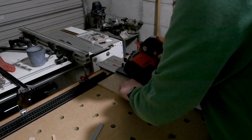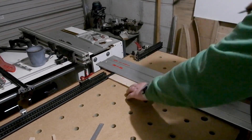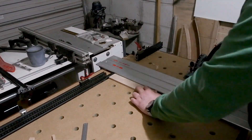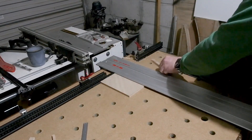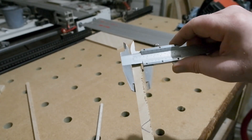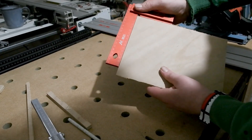That's the build and adjustments all done. All I'm doing now is a five-cut test to check for square. I'll try and keep it all one take and speed through some bits. First cut edge gets marked so I know where I am, then I turn the cut progressively until the marked side comes back around. I'm blowing under the rail between cuts — not always necessary, just want to give the setup its best chance of producing square. When the marked side comes around on the fifth cut I make sure to cut off a measurable rip. On the verniers it lines up perfectly at 13.02mm at one end and precisely 13mm the other — two hundredths over 190mm length. In woodworking terms that is exactly square and I'm more than happy with that.